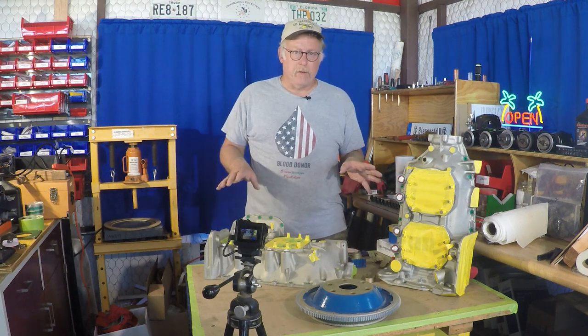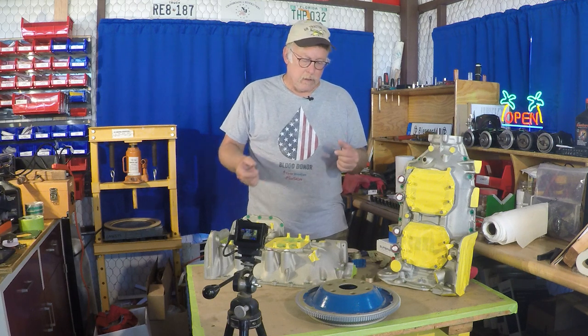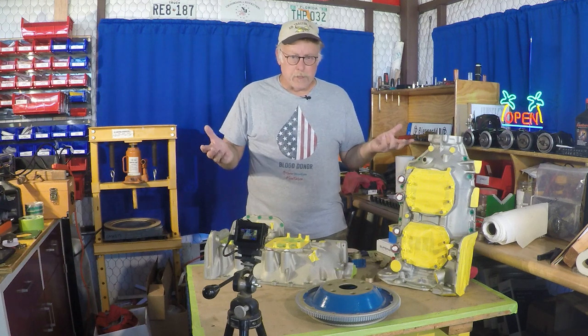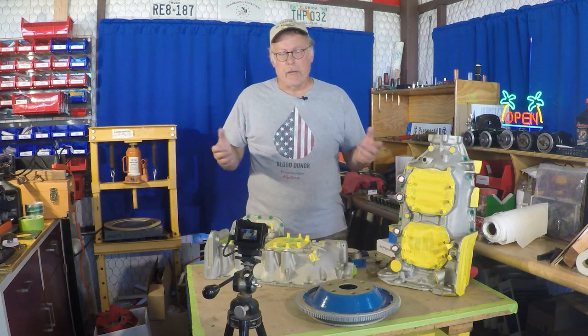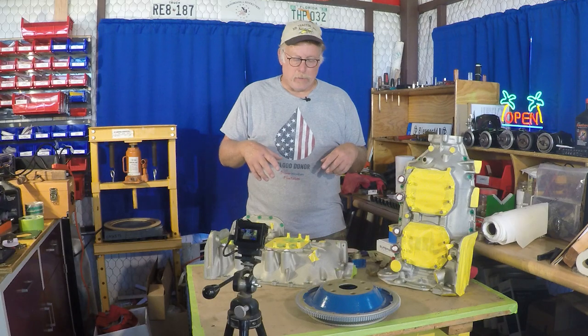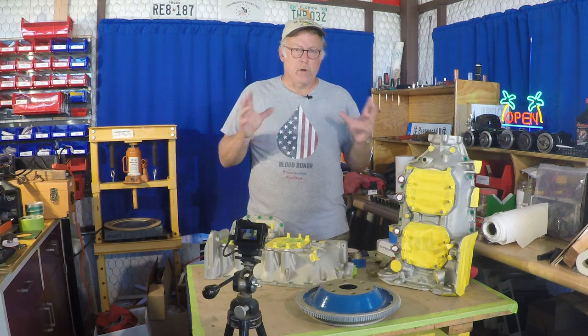We're painting them separately. You don't have to do that. For a fleet engine there's nothing wrong with painting an engine all together. When I was in the repair station years ago, and folks are doing it today, even the factory does it — we would just hang the engine by the hook, roll it into the paint booth, completely clean it, degrease it and paint the engine as one big chunk, with cover plates and all that.